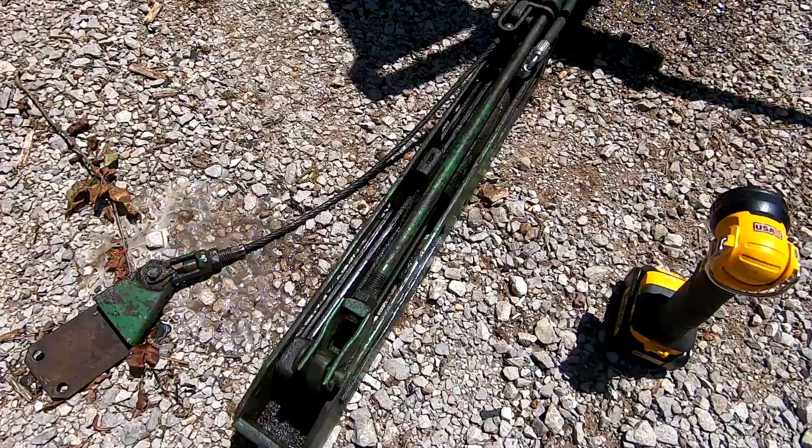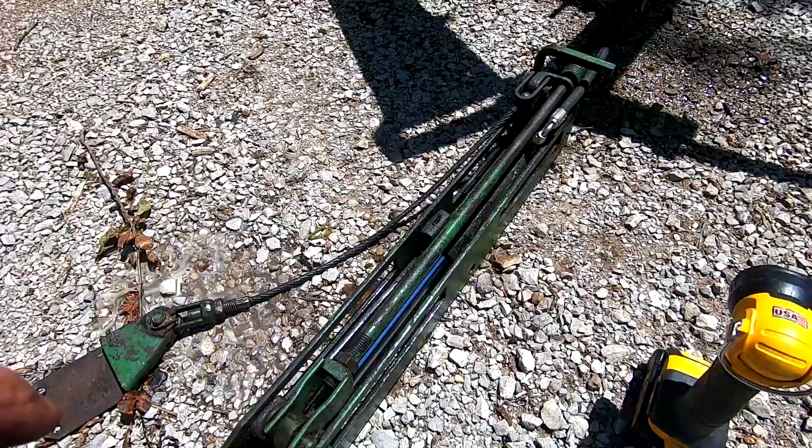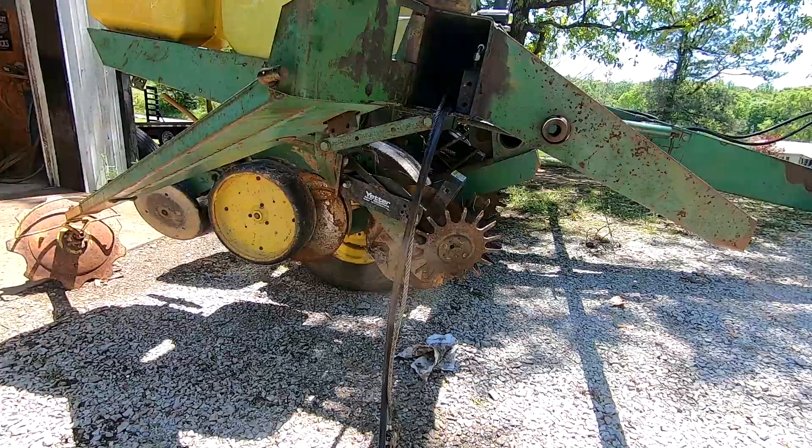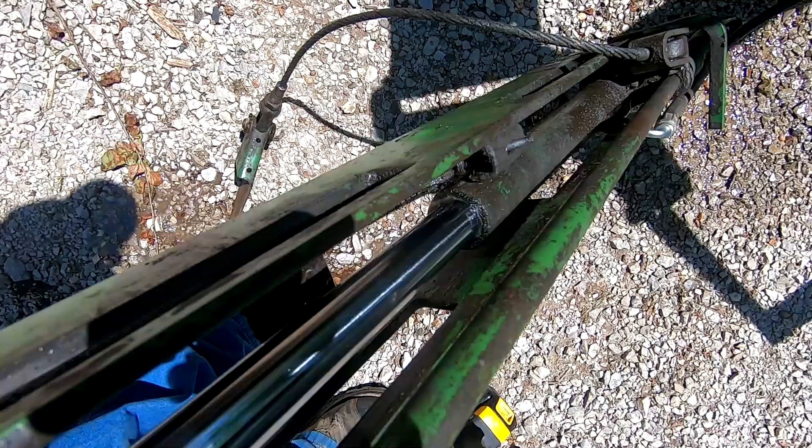Okay, I got it out. What it was — this little piece right here was hanging on the bracket where it bolts in up there. And I found the oil leak. It's exactly what I was hoping it wouldn't be. I would have been happy if it had been one of these flex lines, or even if it had been the steel line inside I had a fix for that — but if you can see here, it's coming out of that cylinder. That cylinder is blown.